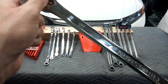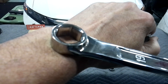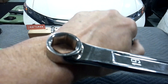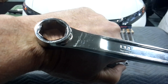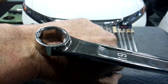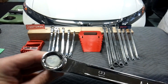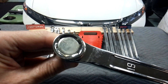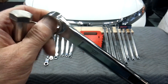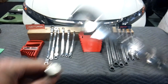And here's why I like these wrenches — you flip it over. Let's get a close-up of that chamfer for all those guys out there that are into the loading. That's got a good amount of chamfer on there. This is a six-point box. That is snug as a bug. When you live in a salt belt, a six-point box for breaking loose a bolt is your best friend — it fits as snug as a bug.